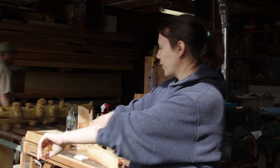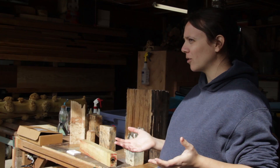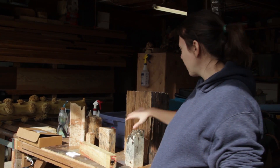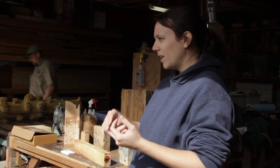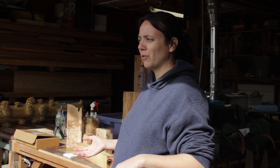The things they don't have examples of here, and I didn't even think to bring them, are pigmented wood - stuff that I think a lot of people tend to overlook in terms of spalting. Spalting isn't just white rot and zone lines and some blue stain. It can be pink, it can be yellow, it can be purple. All the colors of the rainbow pretty much are possible on wood if you know which fungi to use.